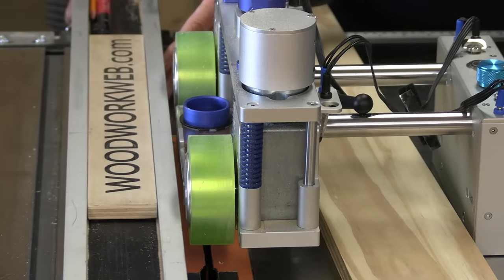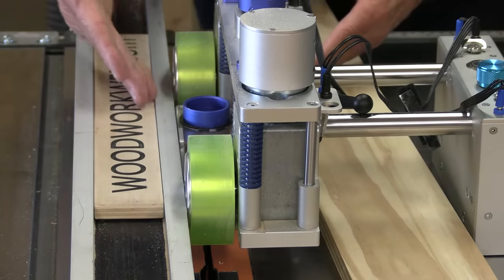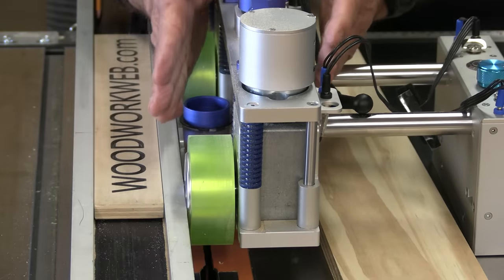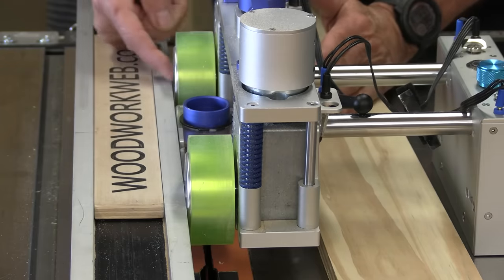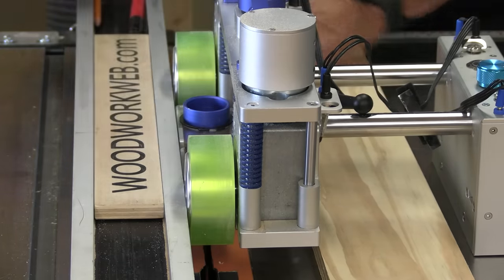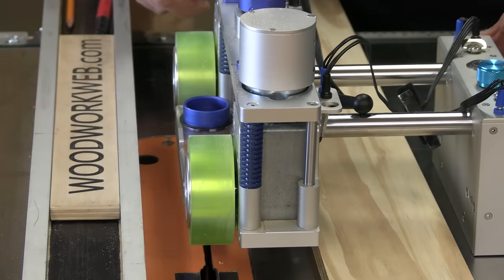The first thing you do is move your fence over and align the wheels so that they're parallel to the fence. I like to have mine just a little bit askew so that the wheels are driving into the fence. You can see there's a tiny bit of a gap at the back and it's firm up at the front. Now I'm locking that in place with the electromagnet.